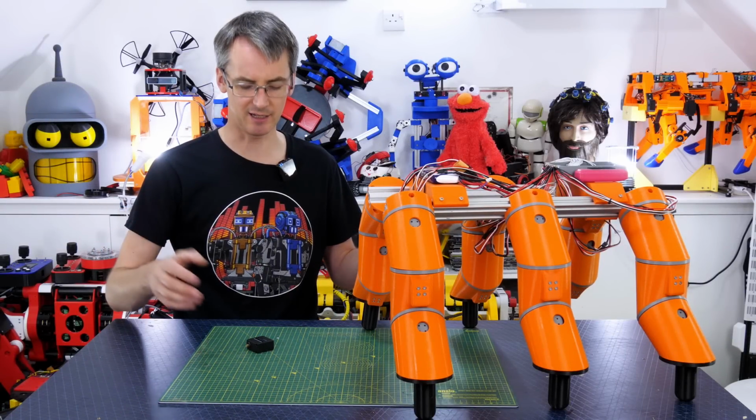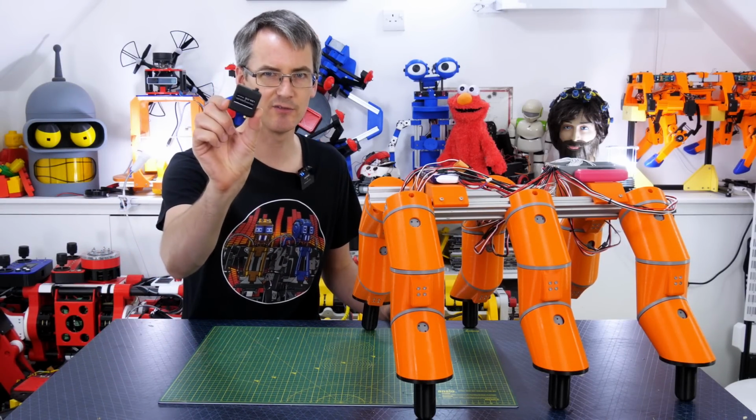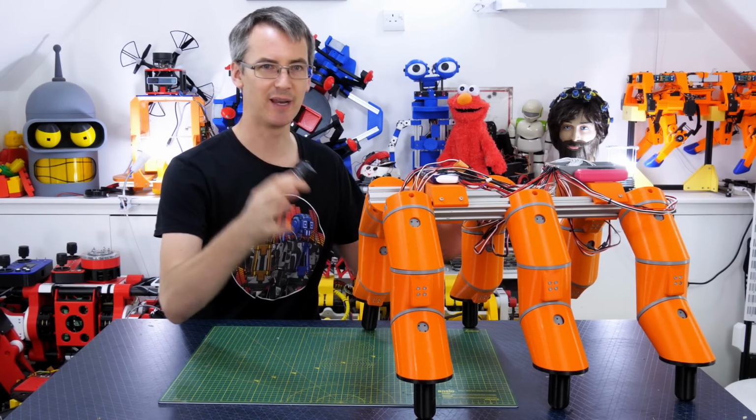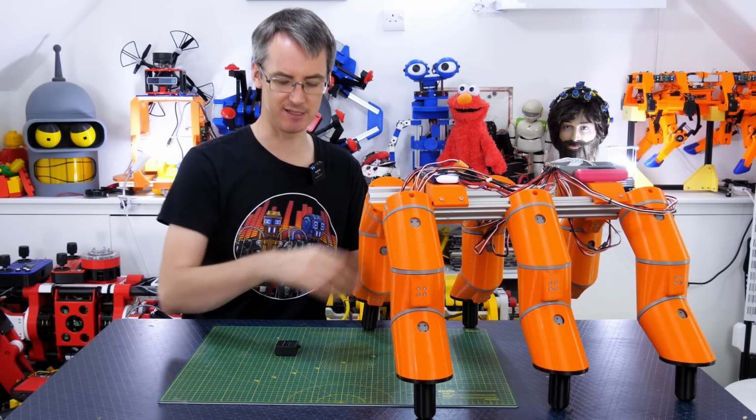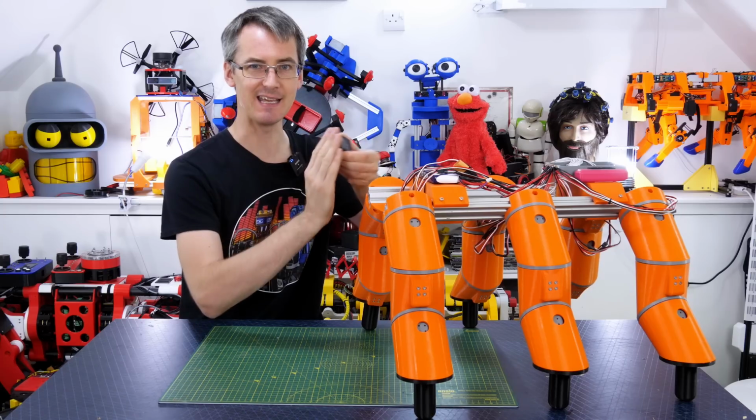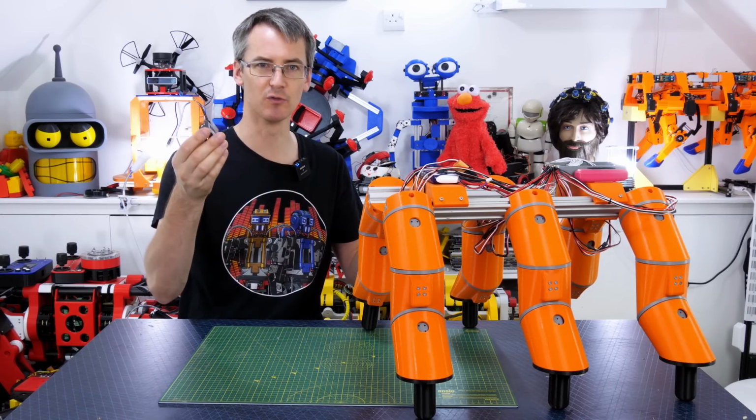I'm not too unhappy with that. I'm mainly impressed by how tiny these servos are relative to that mechanism and how big the machine's turned out and how it still works well. And that's all owing to this rotary mechanism and not putting the joints directly on the servo to back drive it or cause too much force.